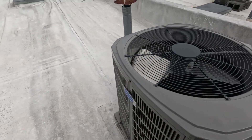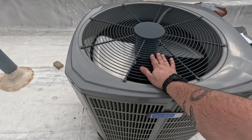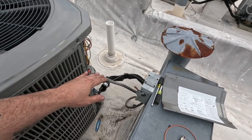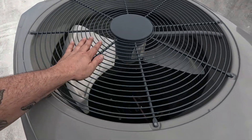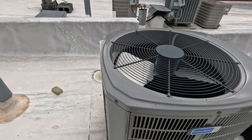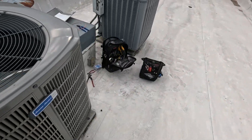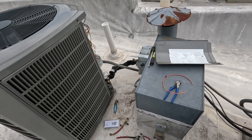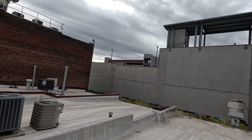What that's doing is cycling on liquid line head pressure - actually cycling on liquid line pressure right now because we're on the liquid line, which is correct for a fan cycling switch. It's a 400 cut-in, 300 cut-out, so that should be good to get them through the winter. Anyway, I'm gonna clean this up, put the panel back on, and that's a wrap for this one. Thanks for watching.